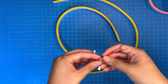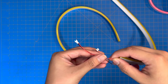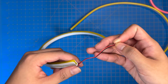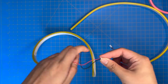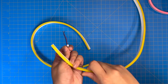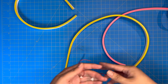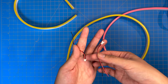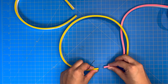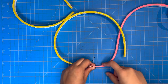So instead I'm going to solder this connector onto each side, and then I'll be able to connect them together and it should behave as one long strip. Because I'm able to cut all of these to smaller strips and then reconnect using connectors, it means that I'm not limited to a single color of LED strip. I can connect multiple different colors together in order and make a multicolor design like I'm intending to do.